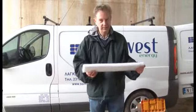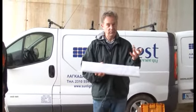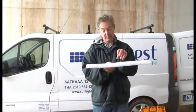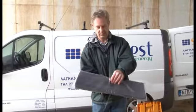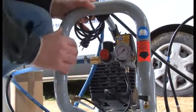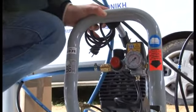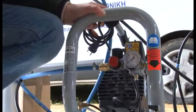For the heavy duty cleaner, you have to remove the heavy contamination and the sand from the solar panels. And you don't do that with a cloth, but you do that with this scrubbing pad. With the shield, you use these soft cloths. And how you apply? There are 2 pressure meters on it. They are pre-installed. What's important is that the only pressure we need is about 2 bars, 1.8 to 2 bars, to get already to 10 meters.